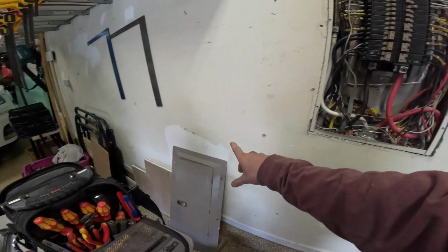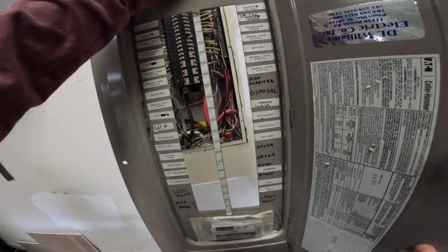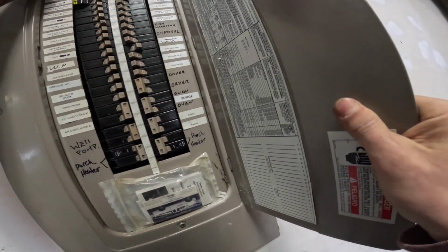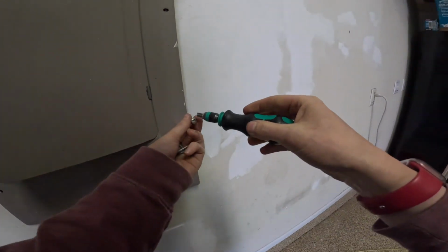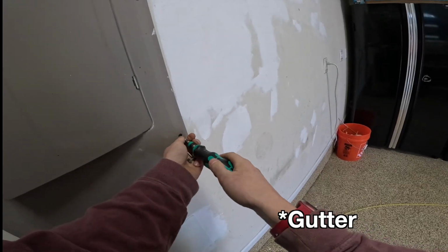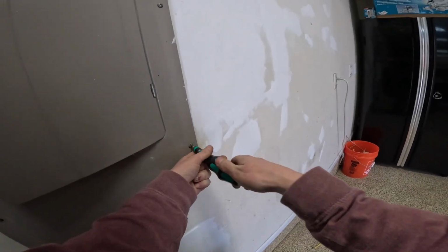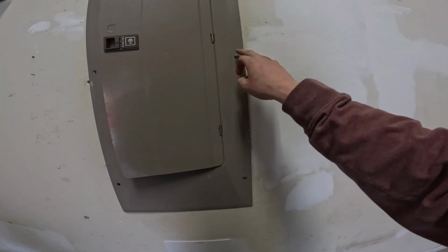We're going to put the cover back on the panel and get it relabeled. Pull this out. Line it up carefully. You get the top 2 in there to hold it in place, and then get the other 4. When you're pushing your wires into the trough inside the panel, always make sure that there aren't any wires tucked up in this front corner here next to where the screws are going to go through.